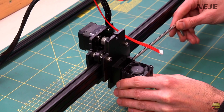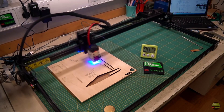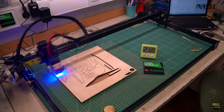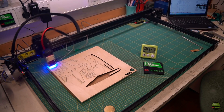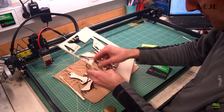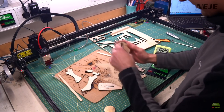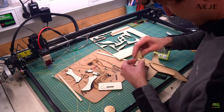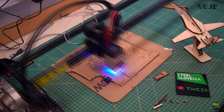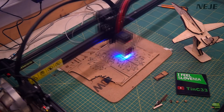I also mounted the laser on Neji Max to cut some wood pieces — first from 5 mm poplar plywood with settings 10 mm/s, 40% laser power, single pass for engraving, and 5 mm/s, 100% laser power, 3 passes for cutting. For puzzle DXF files just search Google for DXF files for laser cutting and you'll get a bunch of results. Then I made a puzzle out of 3 mm MDF using the same settings but 4 passes for the cutting layer, because the MDF was tougher, and puzzles need to be 100% cut through, otherwise tiny parts break when removing uncut sections.